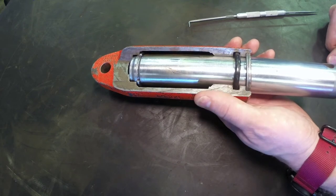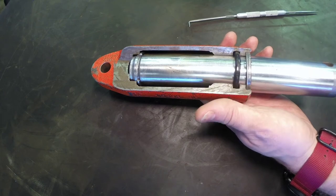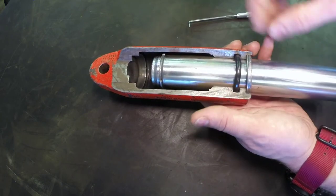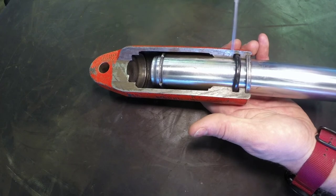This is a very simple, cost-efficient cylinder. It does have some limitations — it doesn't have any pulling force, and it has limitations in overall force generation due to the pressure limits of having such a simple seal rather than a high-pressure seal.